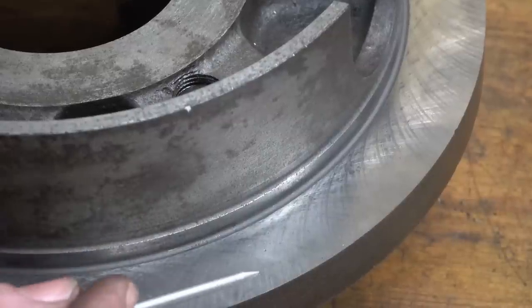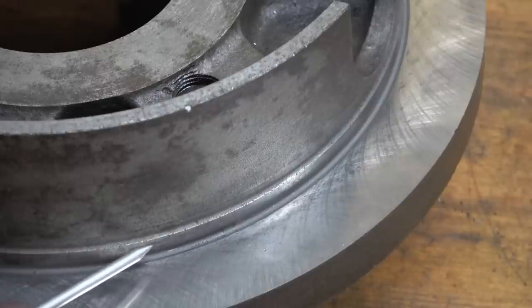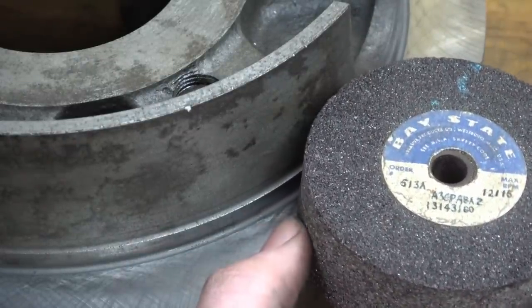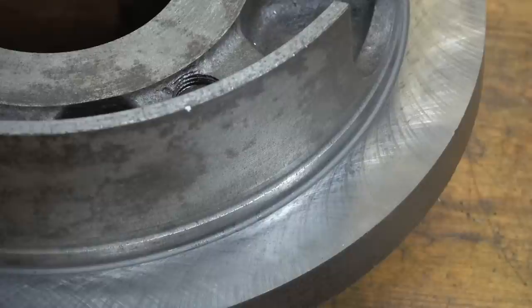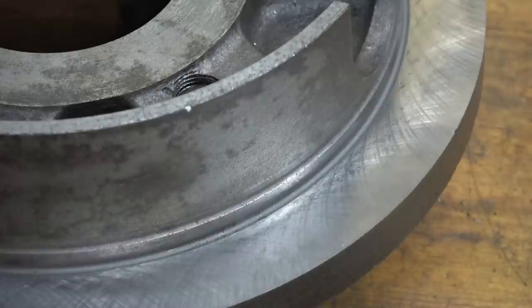Having finished at the lathe, here are a few close-ups. This is the back plate face I've just ground. This is the small corner relief I referred to, and here is the band which interacts with the chuck body that I opted not to remachine. You can also see the interaction between the corner relief groove and the wheel — not much corner wheel wear would be acceptable, because with how small this groove is, any corner wear could leave a lump that would wreak havoc with the chuck body fit. A nicely sharp cornered redressed wheel guaranteed a nice flat surface with good contact. Well, sherry o'clock is rapidly approaching and I don't want to keep Jefferson waiting — just the chuck jaws to go, so you'll see that in the coming videos. Thank you for watching.